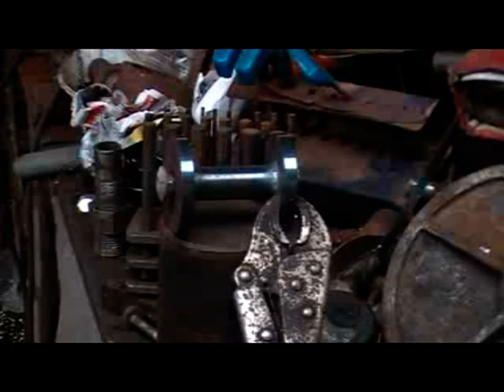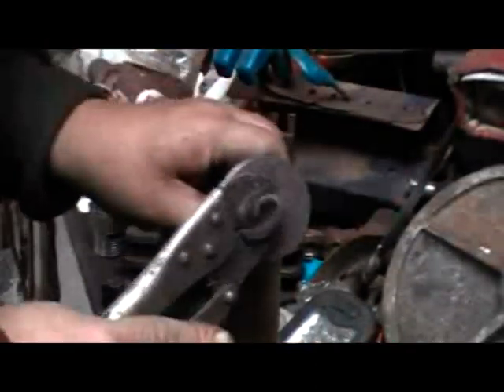Front hub for the Victorian tricycle, and we're off to a flying start. I lost the footage of me machining up the two discs and clamping them together to form the front hub, but as you can see it was a straightforward job to keep everything in alignment and bolt them together so that they don't distort while being welded.